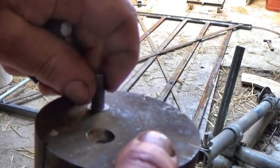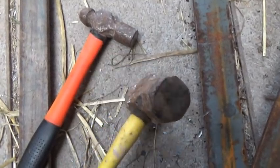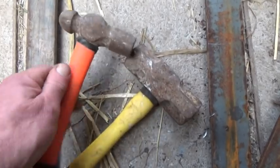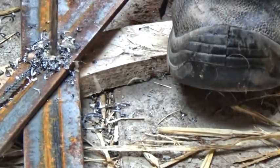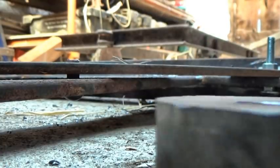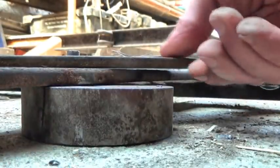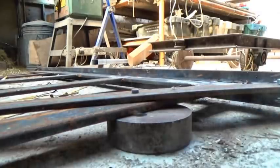I also needed a big square-headed hammer — this splays the head and traps the flat bar — and a round nose or ball peen hammer for rounding over the edges. So I drilled holes everywhere, poked a rivet up through them with the round end protected in the pocket that Will made, and then bashed them, first with the big square hammer, and then with the ball peen hammer.